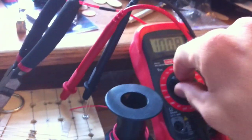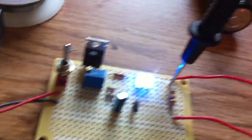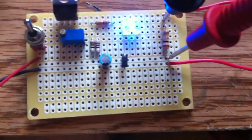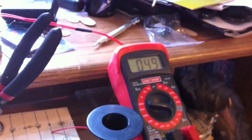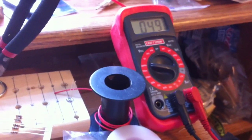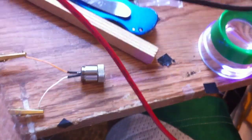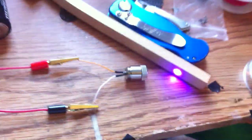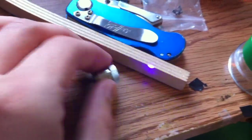Let me get my meter. If I can do this one hand — stick my meter in there and you can see I'm getting 49, 50, 49 milliamps going to the PHR which is on. It's a nice little feature, I like having to see what power output I'm actually getting to a laser.